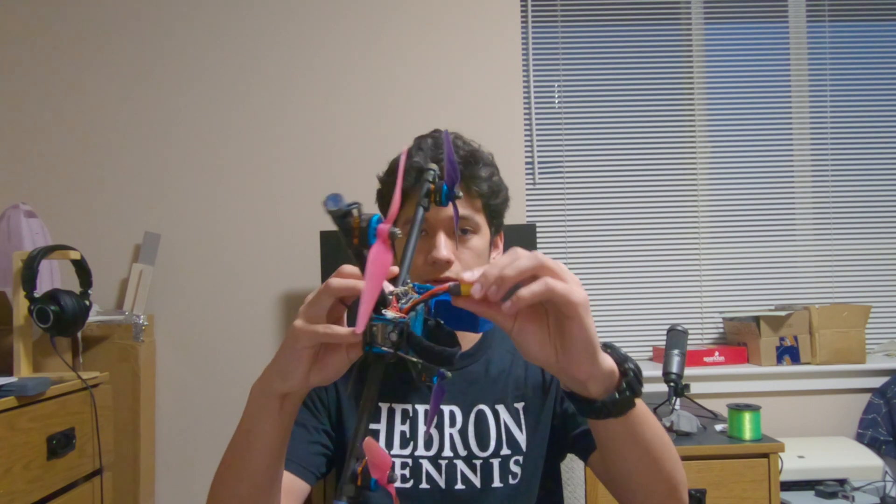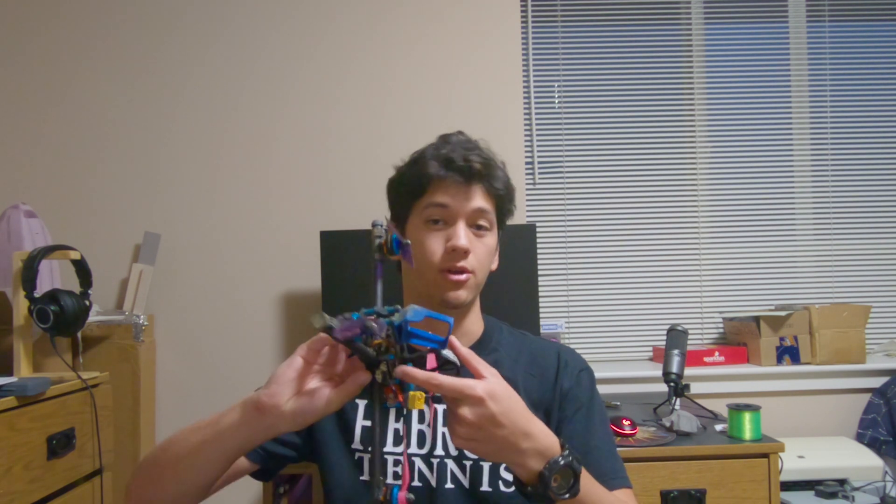Something I noticed was that the back left motor was actually getting warmer than all the other motors. Something else that had recently happened was that the top plate had worn through the battery lead because the battery lead was too short. Another thing that can happen with the tubular quad — with wires running through the arms — is that if you're not careful while assembling it, or if you go through a ton of crashes, the insulation on the motor wires can slowly get worn through. So I pulled apart the entire quad, checked all the motor wires, put heat shrink on any that looked suspicious, and replaced the battery lead with a slightly longer one so the top plate would no longer rub through the insulation.